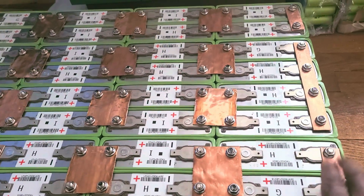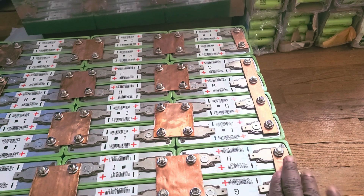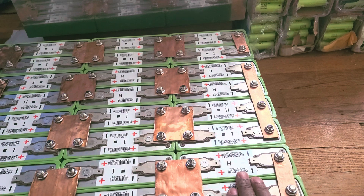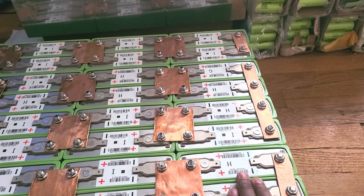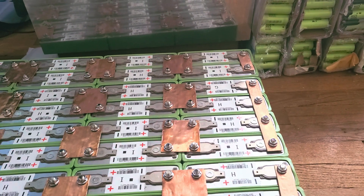I don't plan to tie it up because I'm just doing this for test purposes. I don't think I'll be running this — it's low on energy. Each cell has about 3.1. You're supposed to have this at 52V, but this is exactly 48V. This is my main negative — it says negative right here.